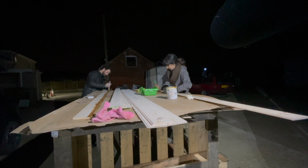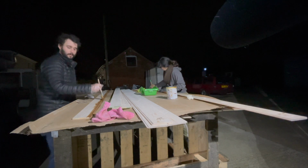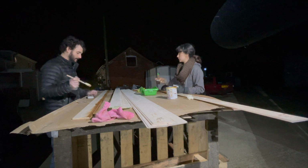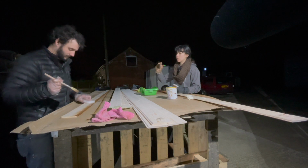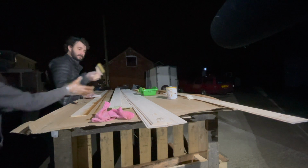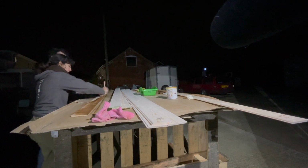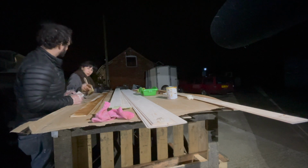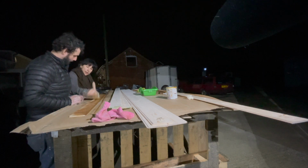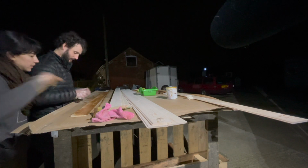So I start by doing the tongue and groove edge, because then you get loads on the main bit of the cladding, and what's already on there, you can start to work. Alex, look. Let me show you. You don't need more. You've got loads on here. It goes really far. Then you start working that in, and make sure you touch up on these edges as you go. Go in a circular motion from one end to another, with the sponge. We've got plenty on there.